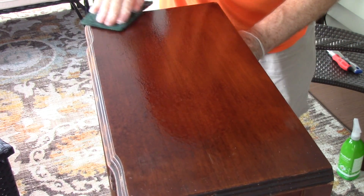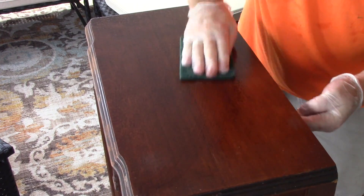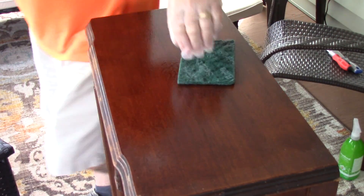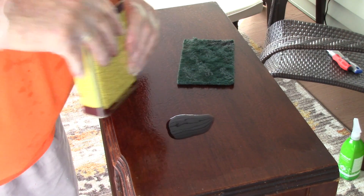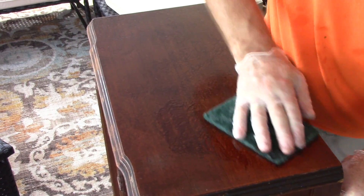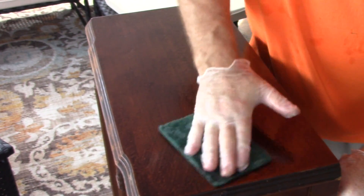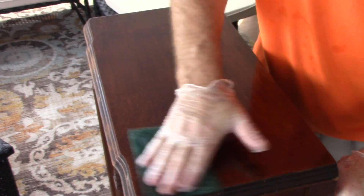So I've been scrubbing the Howard's Restore into this top using a Scotch Brite pad and I think it's doing okay as far as bringing that paint out and fixing the wood. I've got to finish it on this edge over here and we'll wipe it down and see what it looks like. Now technically you're not supposed to pour this directly on, but because the top was as bad as it was, I'm going to put it directly on there anyway. You've got to make sure we've got enough lubrication to get into all these pores and get all that paint out. There was a lot of fine mist type paint besides the big drips.